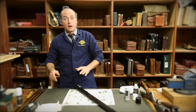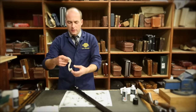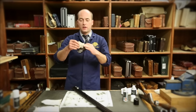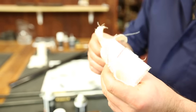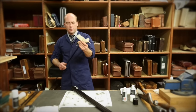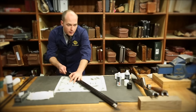Once you've spent a bit of time breaking up the deposits with the phosphor bronze, you can then move on to actually cleaning out the deposits. There are two things you can use for that: a cleaning cloth which comes on a roll, or pre-cut patches — either does the job just as well. Take a piece of rag, fold it in half, and take your brass jag cleaning rod. Put the piece of rag through like so — you don't need to wrap it around, just leave it like so.